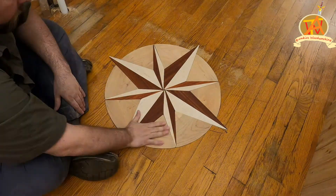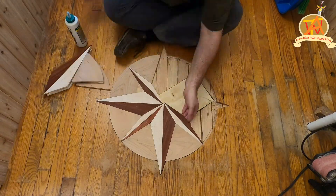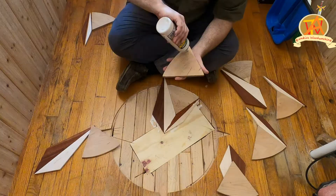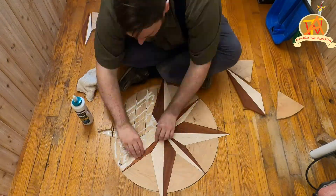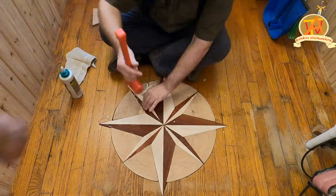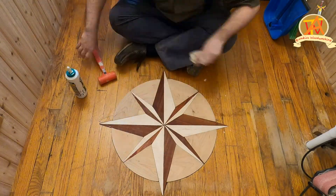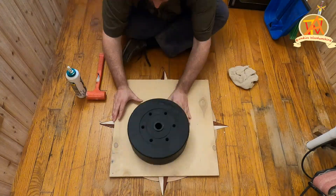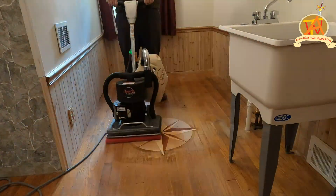It fits! And it looks very pretty. Now we go ahead and take everything out and start the glue-up. We used a generous amount of Titebond III glue for this glue-up. Everything was perfect in the dry fit, but once we added glue I needed to beat it into submission. In Bunky's household the weights are used to hold down the glue-up — I thought that's what they were supposed to be for. And now observe the dance of the Bunky.